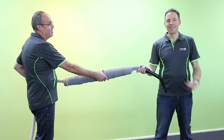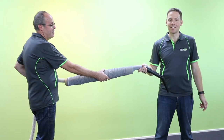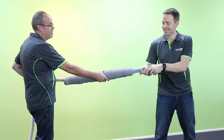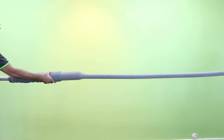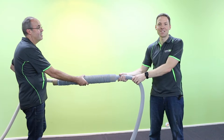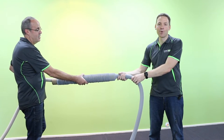I've got my helper now, because we need to pull the rest of the sock off the installation tube, and keep it nice and tight as we're going. So I'm going to walk away, and the sock and tube is going to go the other way. Here we go. Now we're halfway through. You may need to pause and just reposition yourself, but just keep pulling that sock off the tube, and keep walking away with the hose.